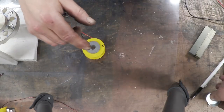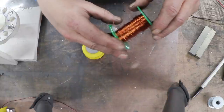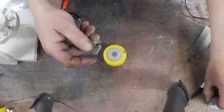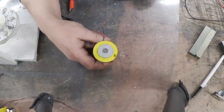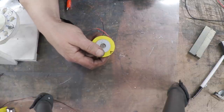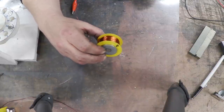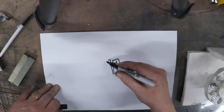I added bits of plastic so the wire didn't rub on the metal, put some tape around the centre, and wound a whole load of copper around it — 0.35mm thickness wire — spinning it on until reasonably full. Then I dropped the neodymium magnets right in the centre of the stack. That's how easy it is — not much more than gluing some washers together. I chose those sizes because that's what I had; if you have 6mm magnets, use 6mm washers and so on. That makes the activation coil.